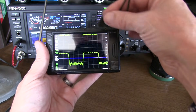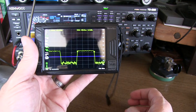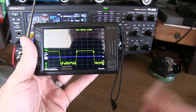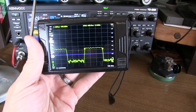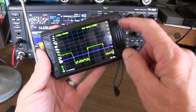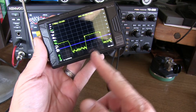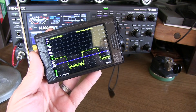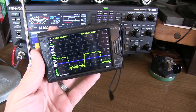Looking at the measurement, we can see it reads 60.2 milliseconds. That tells me that the setting on the radio at 20 words a minute produces basically a 60 millisecond pulse — so the setting is accurate to the words per minute I asked for. I hope you enjoyed this short video showing how to use the TinySA Ultra to do zero span measurements and make a timing measurement to validate the keying speed of a radio. If you liked the video, give me a thumbs up — thanks as always for watching, and we'll see you next time.